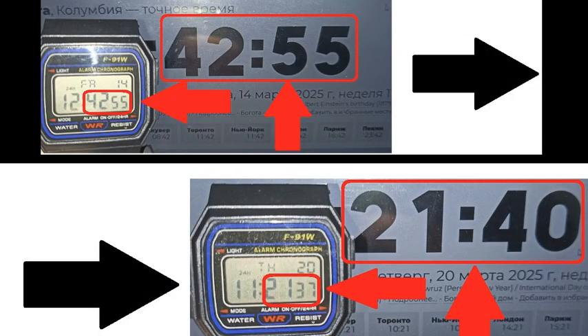It is time to test the time accuracy of the Casio F91W with the replaced quartz. The oscilloscope showed the new quartz has better quality, but the real accuracy inside the watch still needed to be verified. Again, the time was set using the TimeIs website as a baseline and the watch was worn for 6 days. Great news — the inaccuracy dropped to just 3 seconds per 6 days, compared to 63 seconds per 6 days with the original bad quartz.